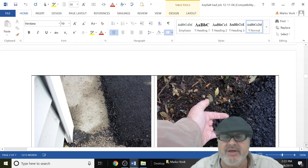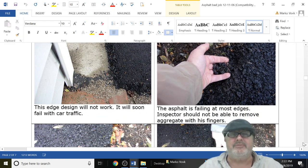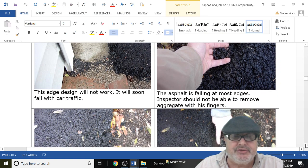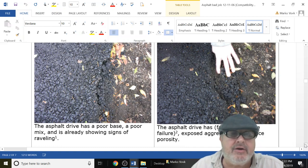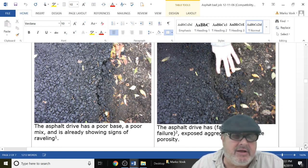And then you got to make sure that you can't damage the asphalt. You can't move the asphalt with your fingers after it's hardened or dried. Finally, the asphalt will cool down once you pack it, and then it will dry, unlike concrete that will chemically react and hydrate. So it won't be hydrating. Let's just call it drying.